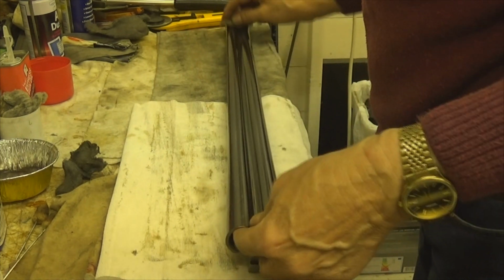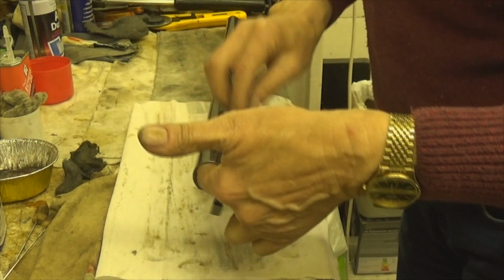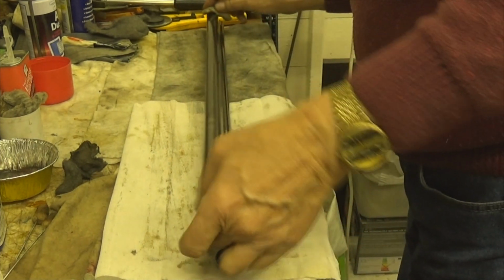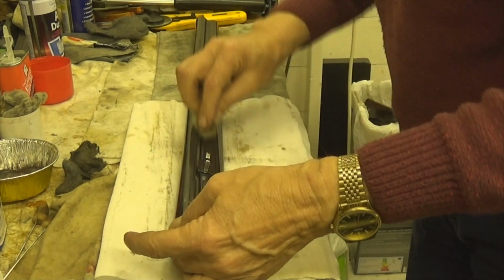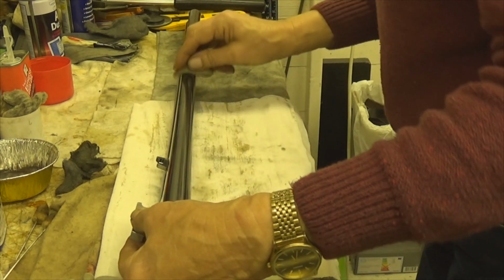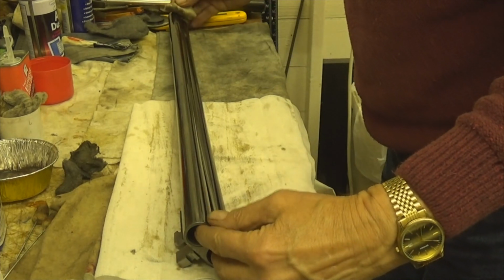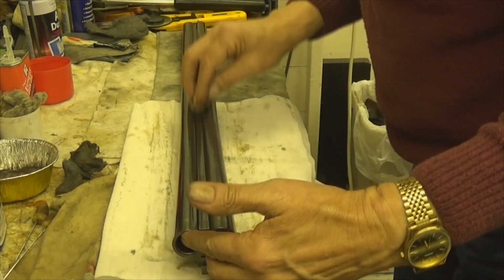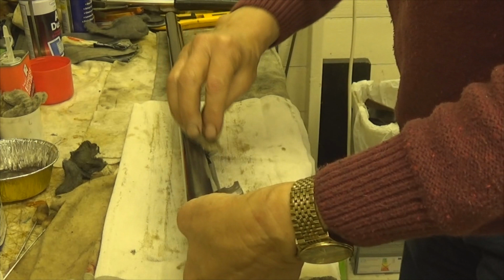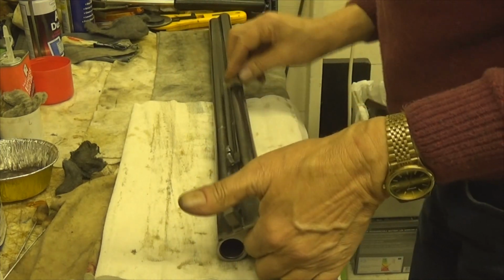And then really you should use rubber gloves on it if you're doing the barrels completely from, how can we say, from chrome, if you like. If you rub them down and they literally look like chrome, you're starting right from basics. So you need to wear your rubber gloves for that, because if you touch the barrels once you clean them off with your fingers, wherever your fingers have gone, the bluing will not cover.